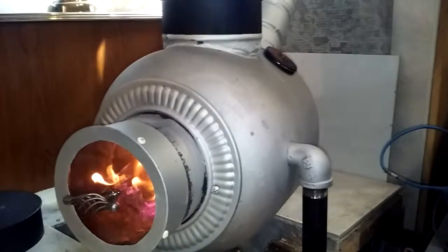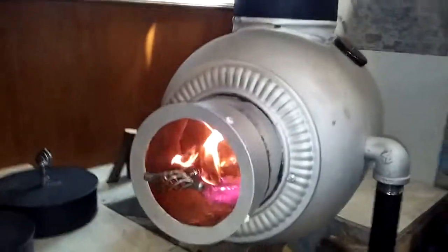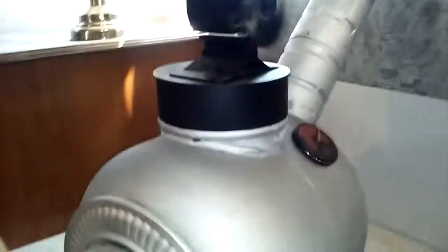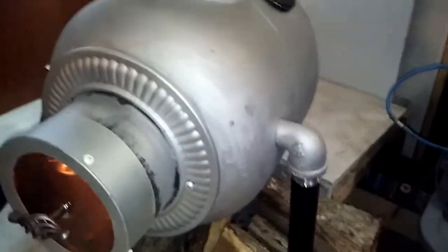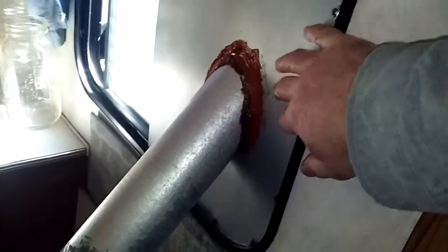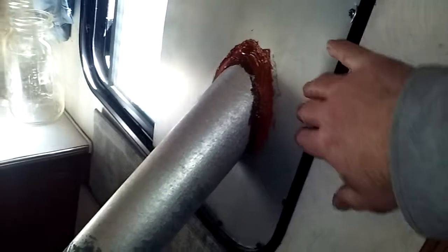I think if it were a hotter fire — a little bit bigger wood stove — the fire would be a lot hotter and you'd get more radiant heat. But mainly this one works off convection. This stove pipe goes through this piece of sheet metal. There's very little conductive heat being spread out there, but that's worked out really well. I used some high-temperature silicone to seal it with.